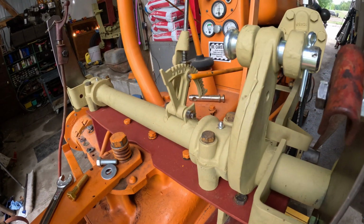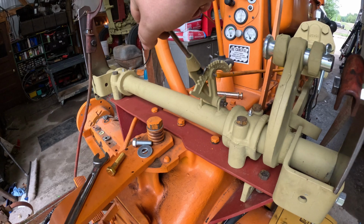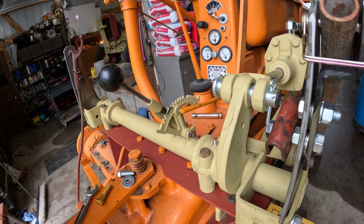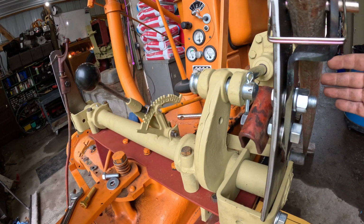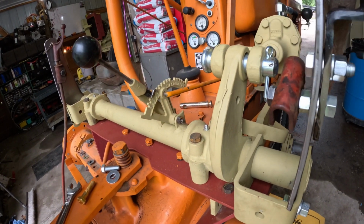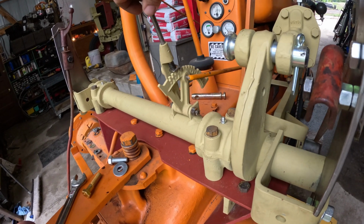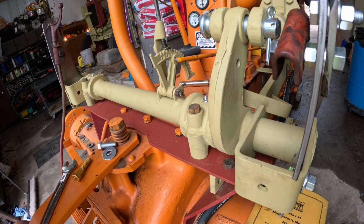And then when you engage this cylinder to the back, right, that's your outward push for the cylinder. So that pushes everything down, and now you're digging, and as you go along, if you should hit a rock and it reverberates back up to the roller lift, and the roller lift gets force against it enough to push back on the ram, then it snaps itself out so that there's no force anymore. If you hit harder or hard enough, it will actually snap it forward and raise everything for you so that you don't damage your shovels.